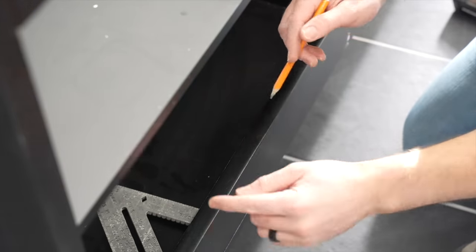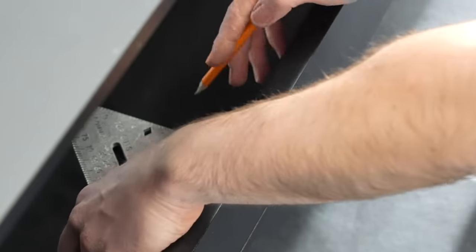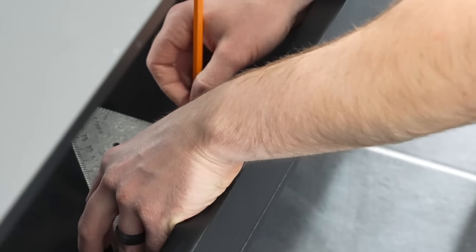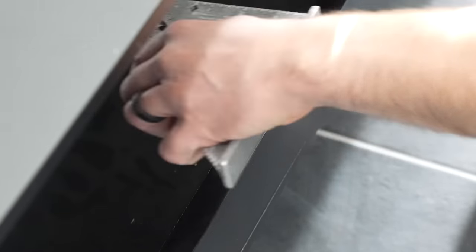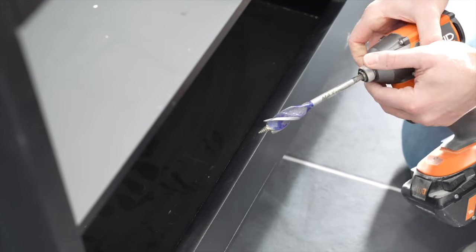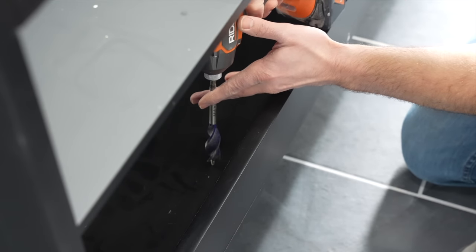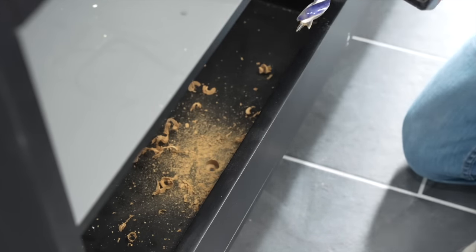I pulled the vanity off the wall — this is the back side. I go to those marks I made from the other side, come in one and three-quarter inches to account for the cabinet thickness, then use a square to get the distance off the back wall. I've got a three-quarter inch drill bit, which gives a little play around the pipe for room for error, and I'm using an impact driver because it's short and fits inside the cabinet. We're just going to drill that out for each water line.